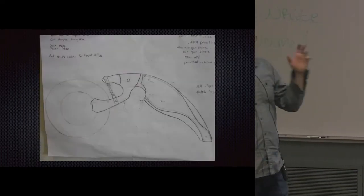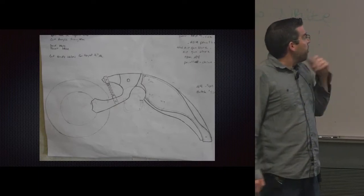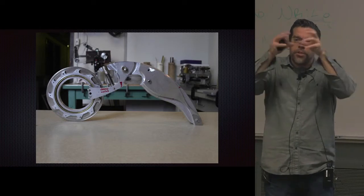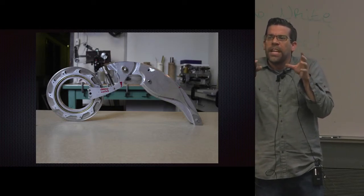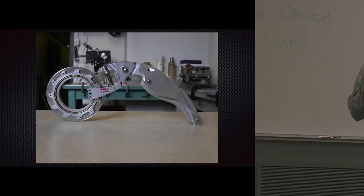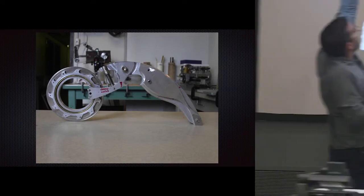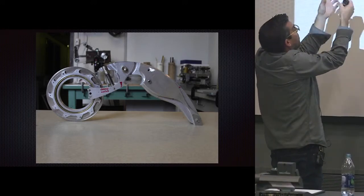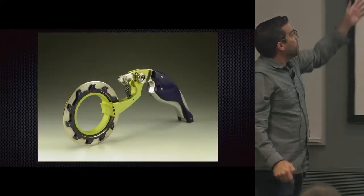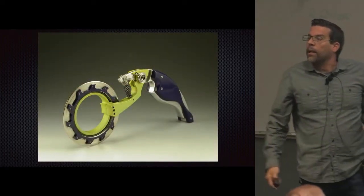I'd love to make a hubless pizza cutter. And so I found this old bearing that was very thin but large diameter, and I took it apart to figure out how it worked. And then I basically measured the specs on it and reduced it down in raw material to make my own bearing. So basically there's a little brass ring, and you pop that brass retaining ring, and then you can slide all the bearings on one side, and the inner and the outer race fall apart. And so that became Psycho Pizza Cadillac.